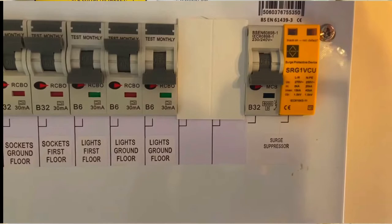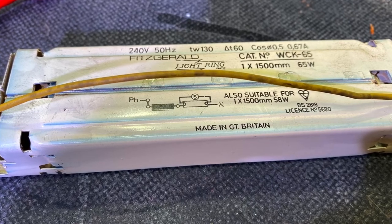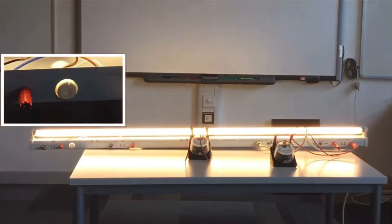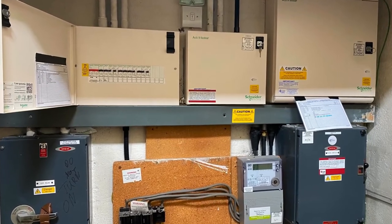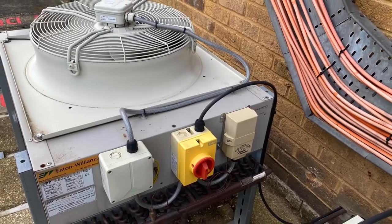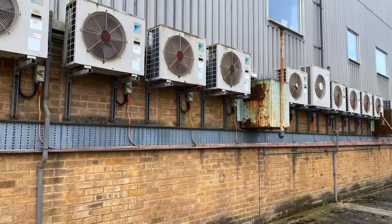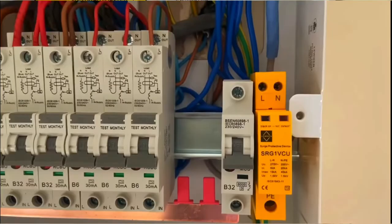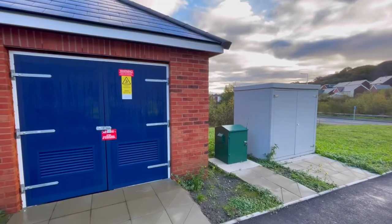The other cause is switching loads. As we've talked about before, a magnetic ballast within a fluorescent light fitting drops a back EMF across the tube. Imagine you were near some industrial work — say near a factory unit with lots of motors, which are inductive loads. If they were turned off, that could effectively drop voltage back into the system at a higher voltage, and that surge above the nominal 230 volts could appear in your installation and cause damage to your electronic components.